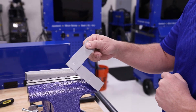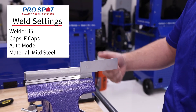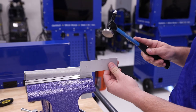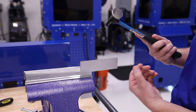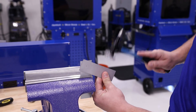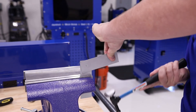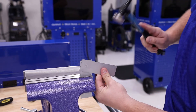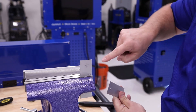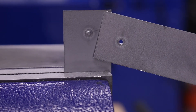We're going to show you what this twist test looks like in the shop setting. We're going to take it and put it into the vise, giving us enough room on the outside to use a hammer. We're going to start hitting the top and you'll see the coupon start to twist — you'll have to go back and forth, hitting the top and then the bottom, until the weld breaks. Once the weld breaks, we can see that the nugget stayed intact on the bottom while ripping out a hole in the top coupon, and we have a successful test.